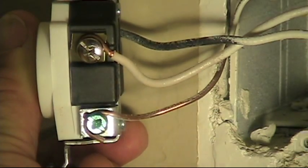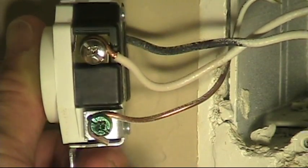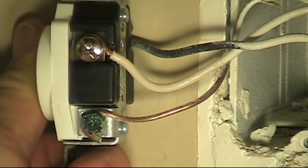There's one more issue — I'm going to fix that — but there's another problem I see here as well. 12 gauge wire is a little harder to work with, and sometimes it's tough to strip. I've mentioned before in some of my articles about being careful not to nick the conductor itself when you're stripping it.